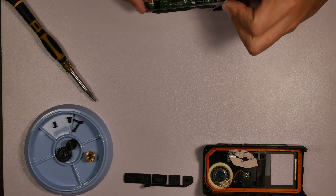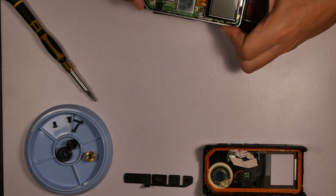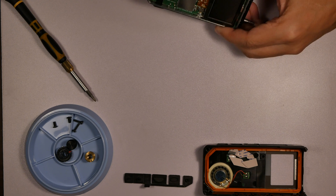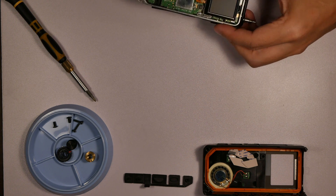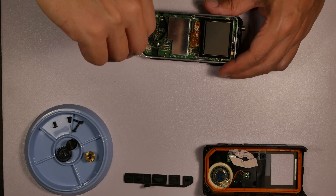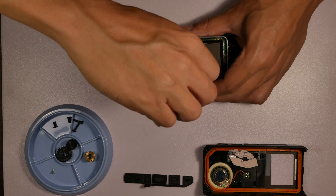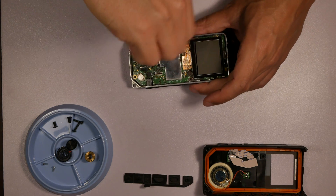I have detailed pictures of all these circuit boards. I was taking apart the whole thing to discover what's going on with it — maybe dump the firmware, find test points, anything available. The first step is just taking the whole thing apart, documenting pictures, and finding data sheets for all the parts. I never did take that little battery out; I'm not sure what it's a battery backup for.